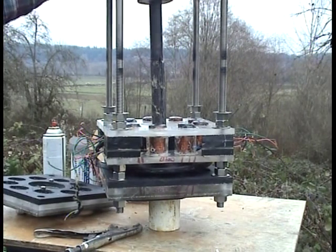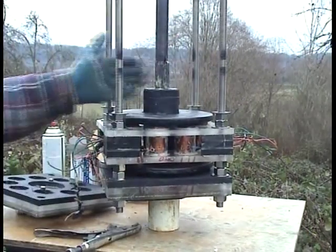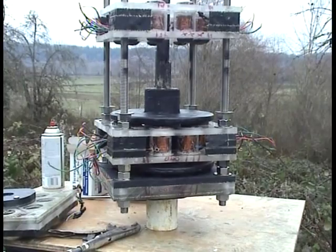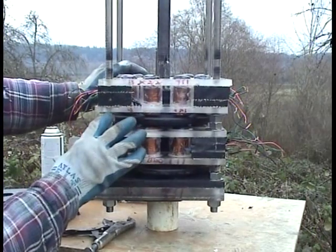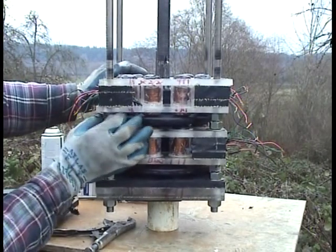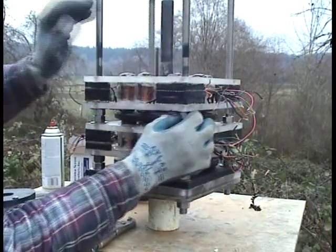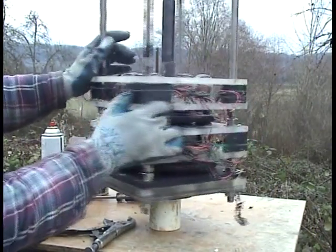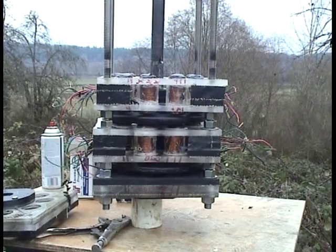Before that next stator plate, put in the second rotor — that is in. Here is the stator plate, the other one in the middle, going right there. It has washers and nuts so you can lift it up a little bit and change the gap with these adjusting nuts. We have red ink marks — see the way the coils line up? So it is in there right.